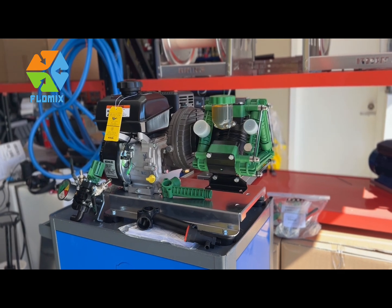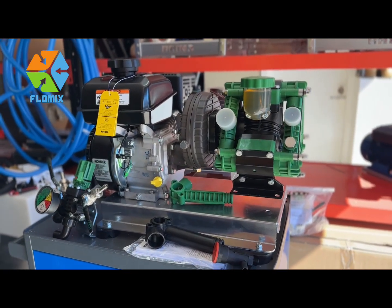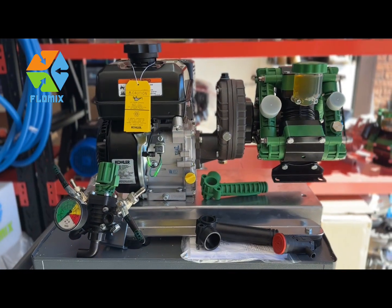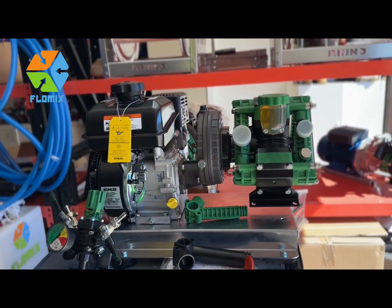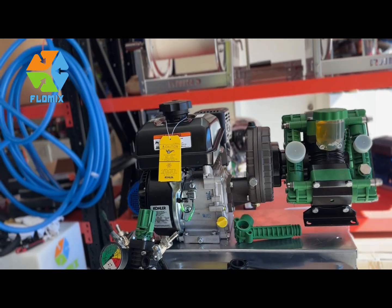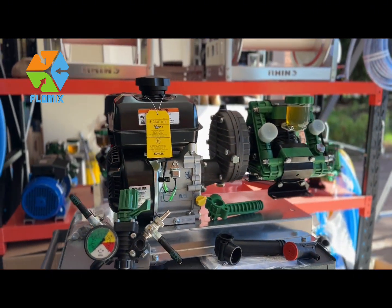So the world is divided in opinion on this kind of pump. There is a side that says they leak, and another side that says they don't leak, and it's basically all about how you set up your pump. When I first got it, I had some issues with leakage, and it was when I operated the pump over 200 psi with a manifold that had a closed loop. So when you release the trigger, the bypass goes into the loop, and if you are using really high pressure, you get the hammer pressure back at the end, breaking manifolds or leaking at the O-rings.